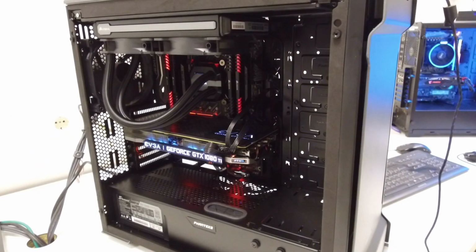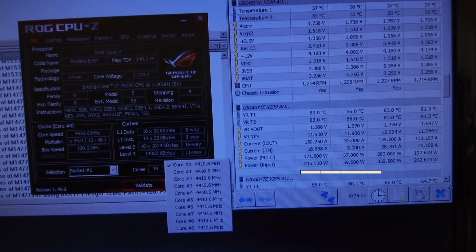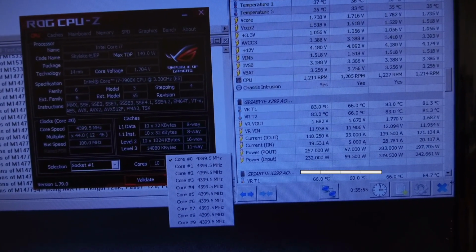Then there's one specific thing I noticed testing the Gigabyte board. I call it VCC in throttling. Not sure if that's the correct terminology for it. So the thing is, I was running everything on auto except for increasing vCore and setting the XMP profile, disabling the turbo and fixing the CPU multiplier to run 4.5 gigahertz. And then I noticed that under load, the power consumption was really fluctuating. So it went from like 260 watt down to 150, to 200, to 260. And that was really strange.